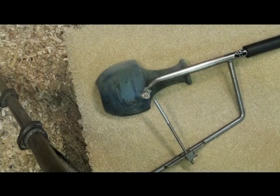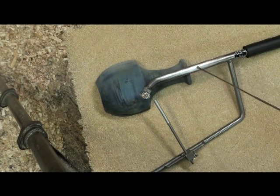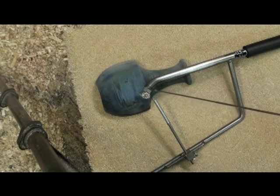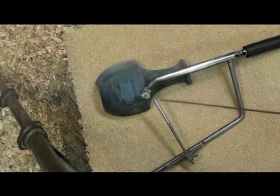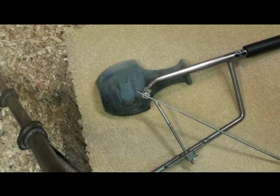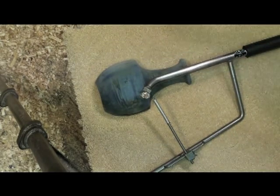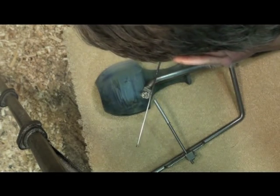Here's a cutaway of a vase, and I have the HK75 set up like I was going to do some hollowing — come in here and take out just a little bit right in here on my initial hollowing with the spring on it. So I have this set up, and I have a straight, invisible line between my spring and my blade. And then the tangent line or the contour line is the exterior of the vase, and it comes across here like this.